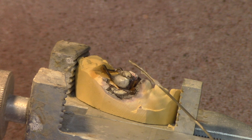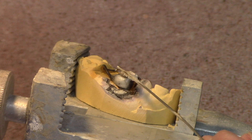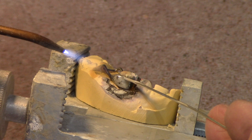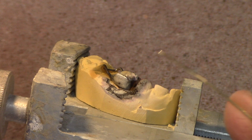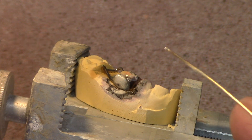It's moving now. I'm going to melt some more solder on top of that solder, and some more solder on top of that solder. The goal here is to give just enough heat to barely melt the solder — it's just an exercise in heat control.